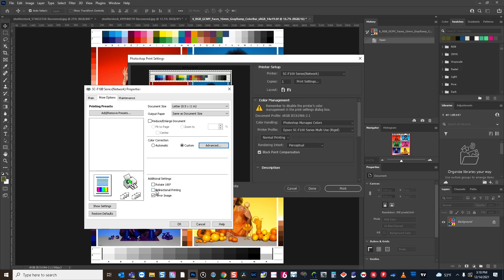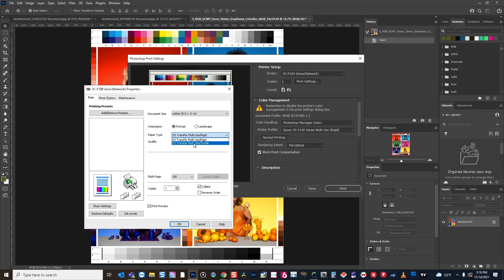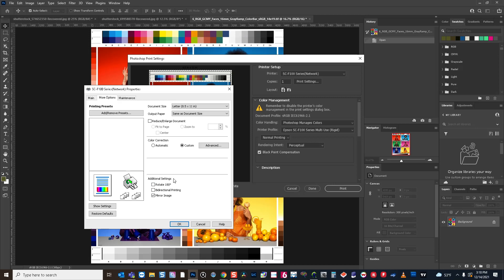The last thing I'd like to mention in terms of print quality is the bi-directional printing button. I would only use bi-directional printing if I was going to a soft substrate or a fabric, because the texture of the fabric will hide any unsharpness from bi-directional printing. The printer would be dropping ink in both ways — right to left and then left to right — so it is faster that way. But when you're on a hard substrate and looking for finer detail and sharper dots, you do want to have this unchecked so that it only lays dots down in one direction.